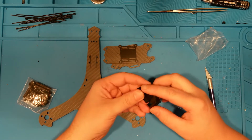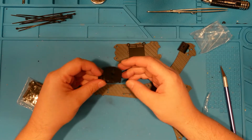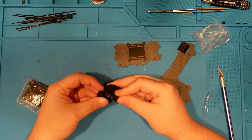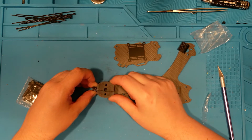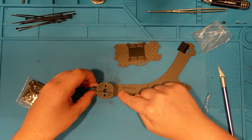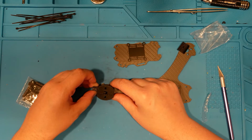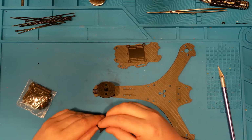And then there's this goofy thing, just like, what is this? Why? In a tricopter, the way it works is you have a mount on a screw in the rear, and the rear blades get turned back and forth by a mounted servo. So the servo goes one way when you want to yaw right, and the other way when you want to yaw left, whatever. You know what I mean. That's how it works, at least that's my understanding of it. And we should have lots of fun trying to make it work.